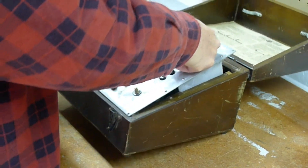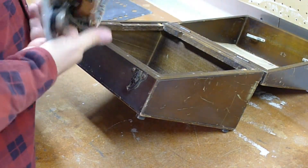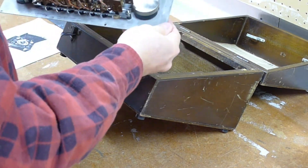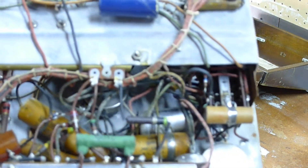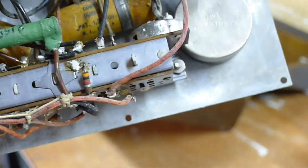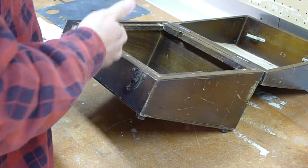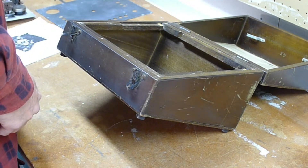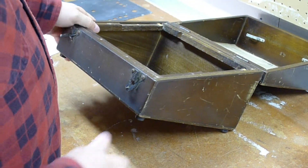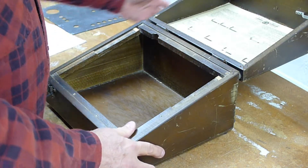This white corrosion is quite heavy actually. I have tried to clean this with another product already. We've got a lot of paper capacitors here, the old electrolytics up here in blue, and all the old resistors — I've ordered everything I need to recap this device and we'll get to that later. I put some silica gel in there to help absorb moisture, because that white corrosion is caused by the thing being stored in a really moist environment.